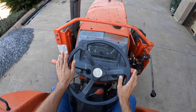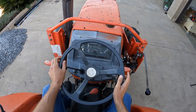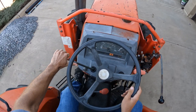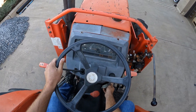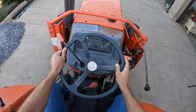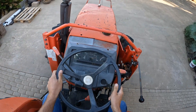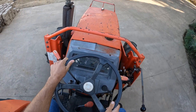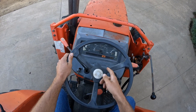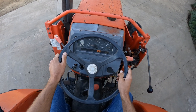Just to show you what I mean — I'm on the tractor, and I'm going to start it, put it in first gear and try to drive. You'll see how quickly it stalls and dies. The engine is at full RPM, and it just has nothing. And you can see how that fuel light came on, so that suggests that there's a problem with the fuel system.